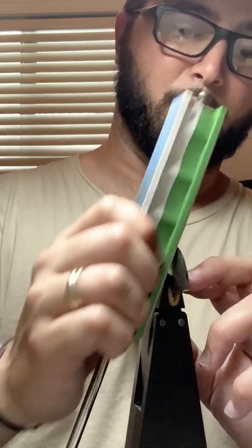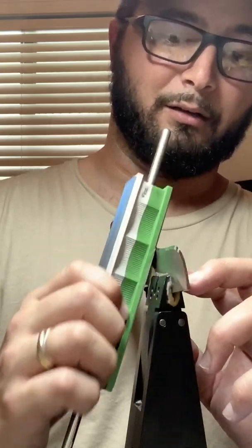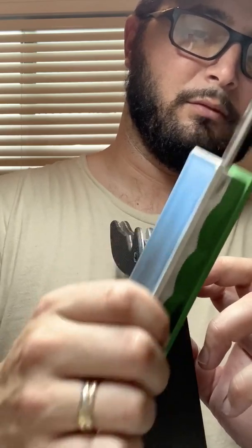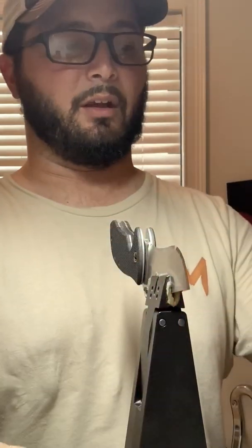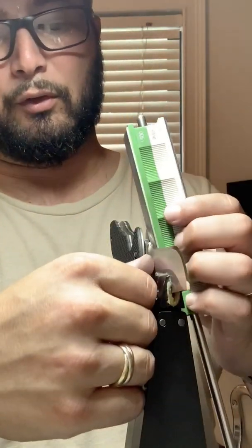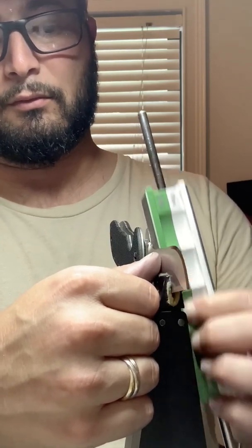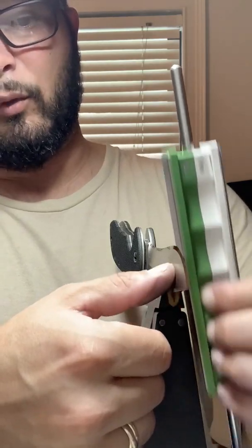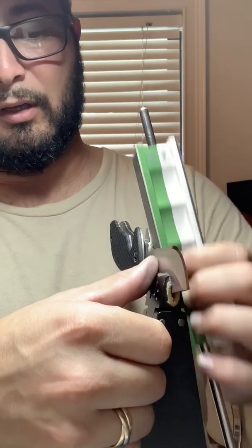The goal is to end with a knife fully sharp, fully apexed, and no burr whatsoever. Sometimes if you're not careful and you're not paying attention, you get to the end and you think the knife is razor sharp, and really what you've left is a hairline burr, and once you break that burr off, the knife is actually not as sharp as it once was. It becomes dull. Not quite as dull as a heavily used knife, but not as sharp as we're intending here.